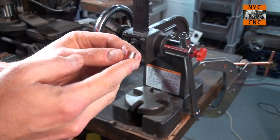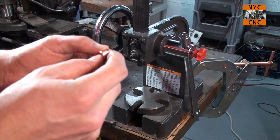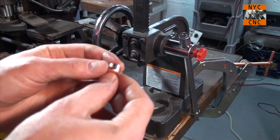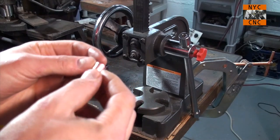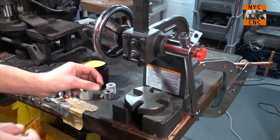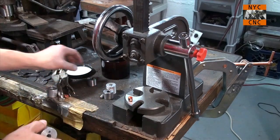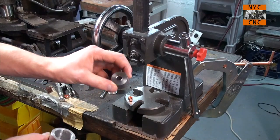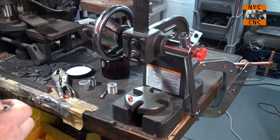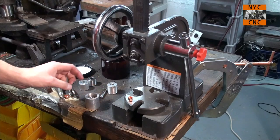I've got to say, I think this is the coolest thing. I really love working in the shop — taking a flat piece of copper, making dies that frankly aren't that hard to make, and turning out something that's so darn shiny and just cool. This is awesome. So let's go ahead now, take this fresh cup we just made, knock out our first die, and stick in our final die. This is bringing it down to 0.353, which is two thou under what we want for nine millimeter, because you end up swaging it out to your final 0.355 size.